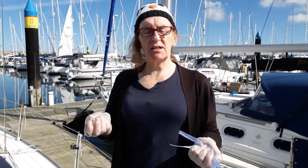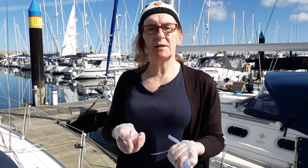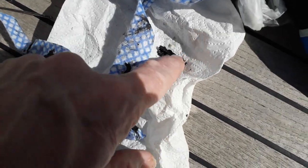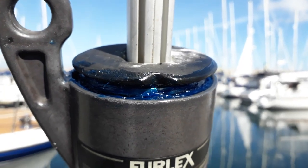We've decided to use today, which is nice and calm, to do the top bearing of the furling mechanism — and I'm glad we did because it is absolutely full of rubbish. I'm picking out the old used grease which has gone hard, cleaning it with white spirit, and when it's fully clean I'll put some fresh Selden grease in and hoist it back up. We're not taking the seal off — the trick is to get this done and get the sail back up before any wind hits.